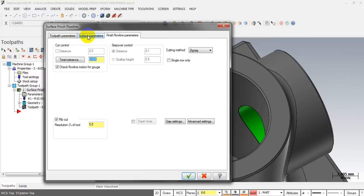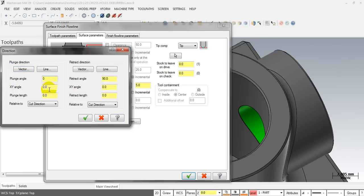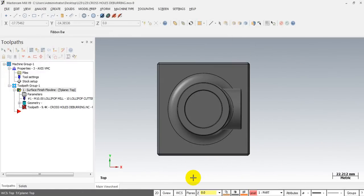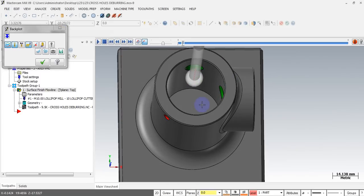We need to create lead-in and lead-out motion. Go to Surface Parameters and click on the Direction option — this allows you to define the lead-in and lead-out motion. For the plunge angle, input zero. For the XY angle, input 90. For the plunge length, input 3 millimeters. For the cut direction, select To Plane X Axis. Click OK and look from the top. Regenerate the toolpath and click on Backplot. You can see the tool now plunges outside of the part — this is the lead-in motion. The tool makes the lead-in at 90 degrees from the X axis of the tool plane.